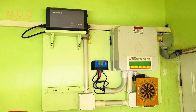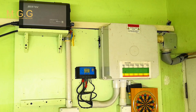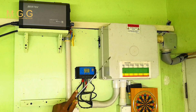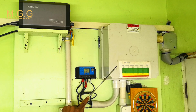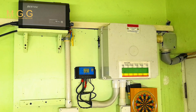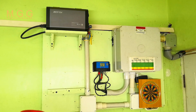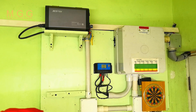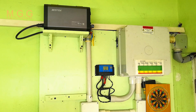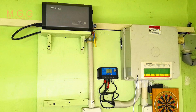Welcome to my small operation center. On the wall behind me, that's where everything comes together. From panel to battery to inverter to the handminer itself, it's all here. In this box we have DC and AC breakers all connected together to make the operation work. At the top of the box is DC, and in the middle is AC. The box has four breakers. I made a dedicated plug for the handminer because I would not want to plug the handminer directly into the inverter, as the handminer runs very hot. Hence I made a dedicated plug for it, coming from that box.